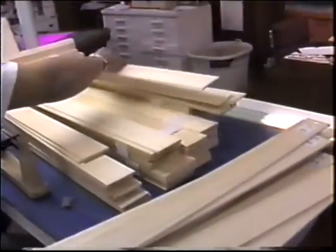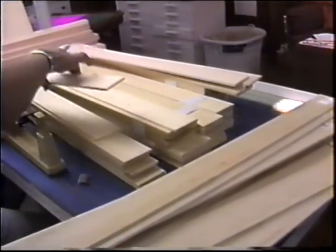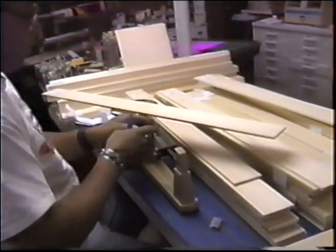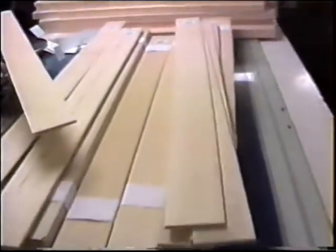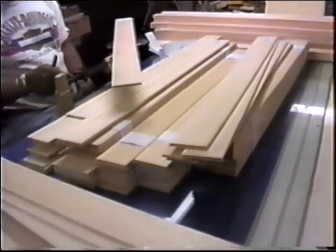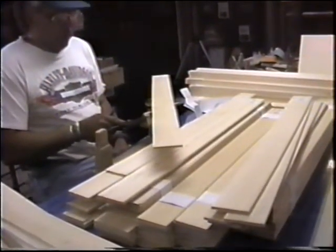Now, this is really time consuming, but if you want to put together real good quality kits, you really do need C-grain wood for flaps. Flaps, rudders, elevators, whatever. You really just can't take the pick of the litter. And this is the little things that I feel make a Cardinal kit worth the time and energy to build it, as you start off having all the wood the right weight and the right kind of wood.